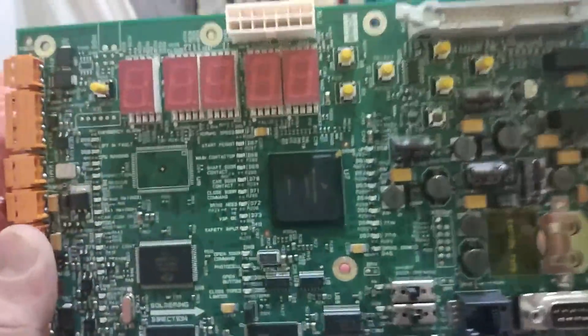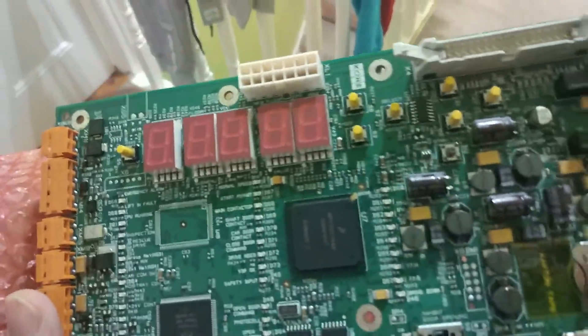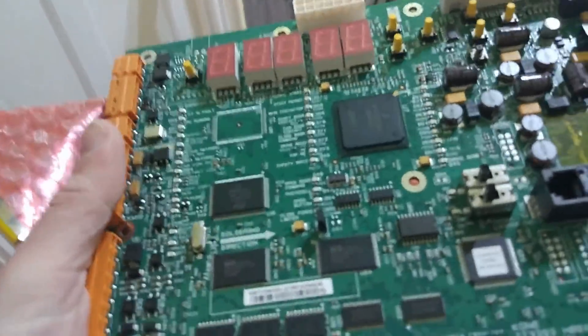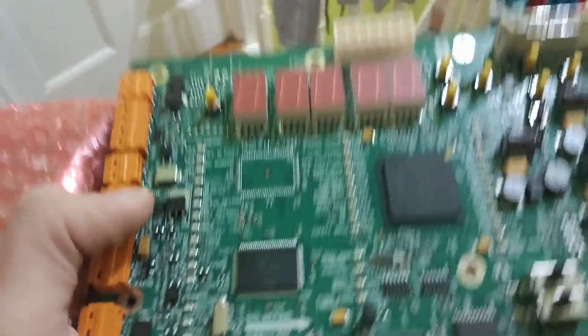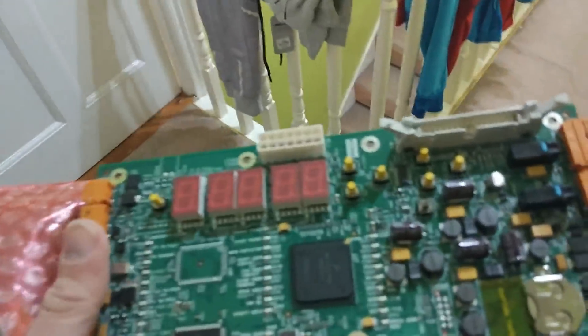It's really nicely designed and it is definitely a real-time operating system, which is just really nice to use compared with the Gen 2 and others that feel like an operating system which the program runs on top of, making it laggy and horrible. This board works the lift nicely — it's nicer than its rivals, probably the best logic out there apart from Mitsubishi. The NV RAM chips save all your settings, stored as numbered entries like menu 1, option 5, setting 10.